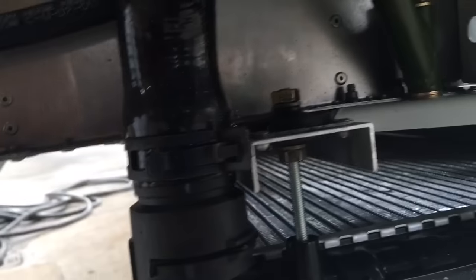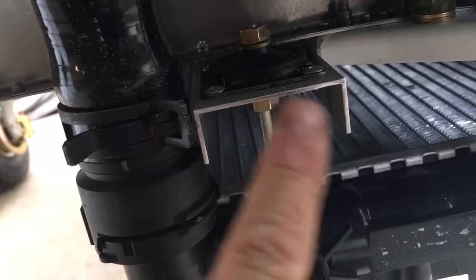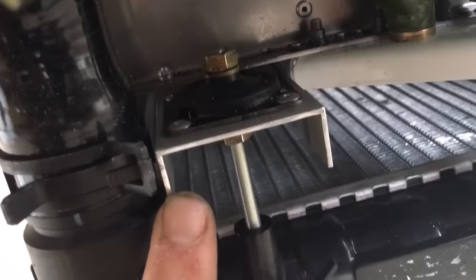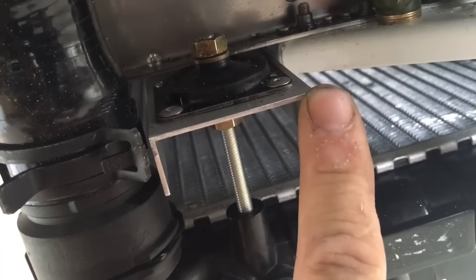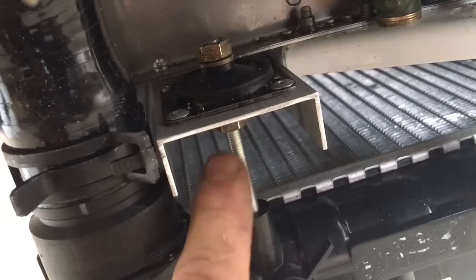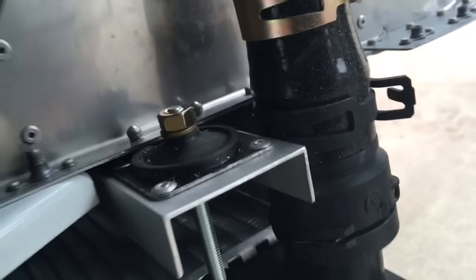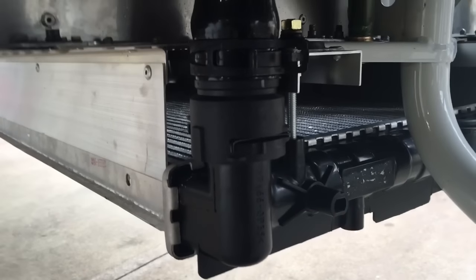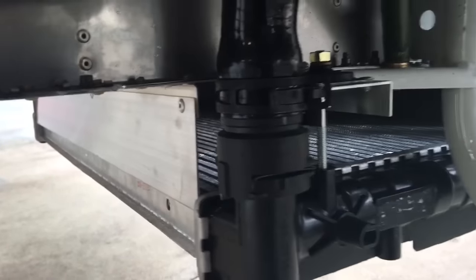The radiator — the reason I said to mount this first — is just some 1/16-inch channel from McMaster. You get a couple pieces of that, a foot of it, in order to mount these ahead of the firewall. You rivet this to the bottom of the airplane with four rivets or so, then move the mounts to here. Line this up, put something underneath the radiator to hold it in place while you work — that lines up the radiator mounts in the front. These are quick disconnects by the way, so you can push these wires back and this pops right out — it has an o-ring inside. That's basically the radiator mounting.